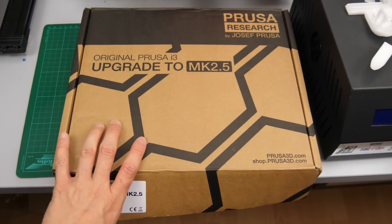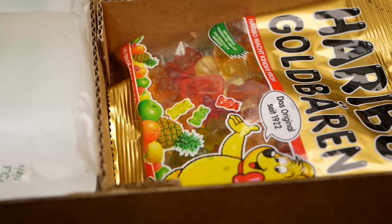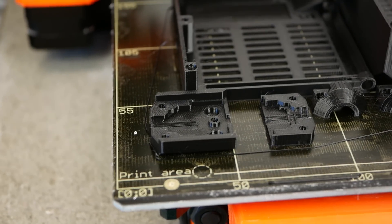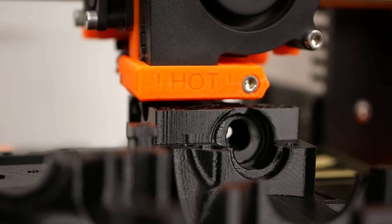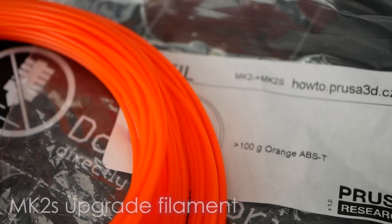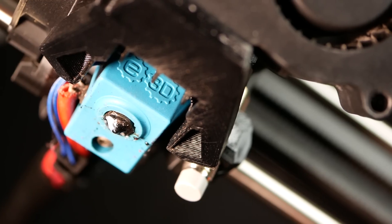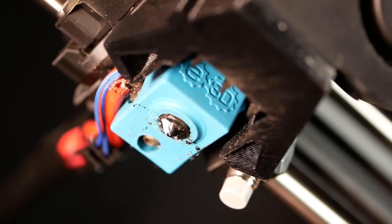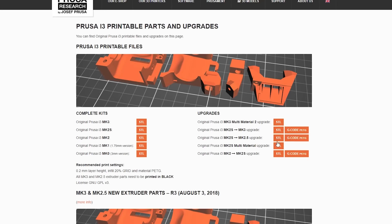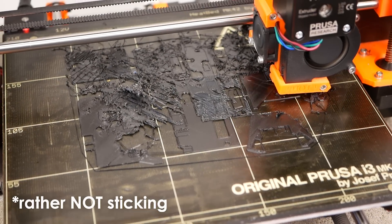The upgrade kit comes with everything you need — all the parts and tools, and even a pack of Haribo, which might be necessary since the whole upgrade process will take you around 4 to 6 hours. It also comes with a roll of PET filament that you'll need to print out the required parts for the upgrade, most prominently the electronics enclosure and the extruder assembly. I was a bit upset that they included black filament because I always enjoyed the look of the old orange parts. Contrary to their old printers, Prusa switched from printing parts in ABS to PET, which makes the printing process easier and less smelly. Only the cooling fan shroud is provided as a pre-printed ABS part because it has to withstand the temperatures of the heater block. The parts can be downloaded as pre-sliced G-code or as separate STLs from the Prusa site. I had some issues with materials sticking to bare PEI but finally got it to stick with an application of Magigoo.